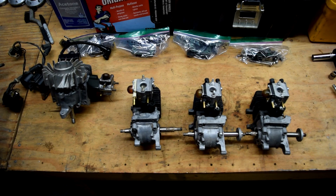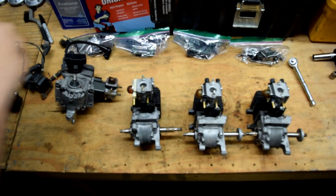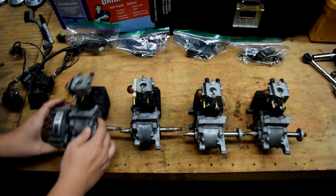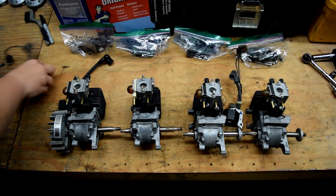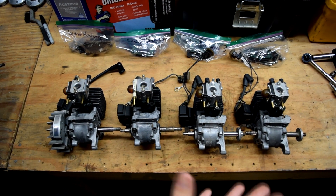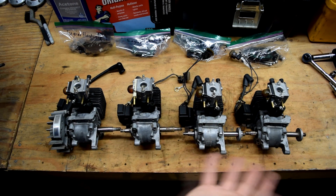Oh yes, look at that — starting to take shape! I lay out all four one-cylinder engines on the bench. For this build, I don't want four separate flywheels just stuck together — that's not a single engine. A single engine has a solid crankshaft, or as close as you can get to one. You'd get four one-cylinder engines because that's what it is. But for this, we have our flywheel, and I don't want to just have four of them stuck together.